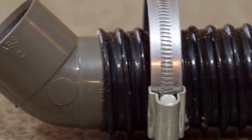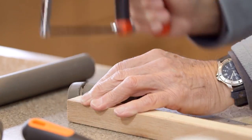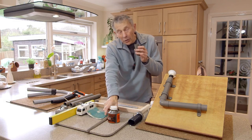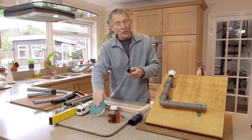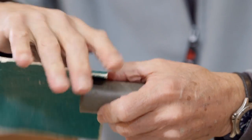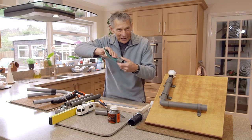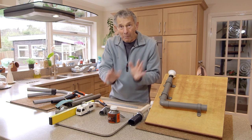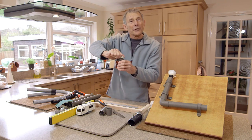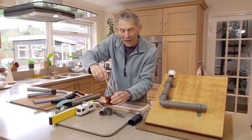So we buy this pipe and let's go through the processes. We can cut it to length with a hacksaw. Once you've got the rough cut ends, you can use a file to smooth the ends and smooth the inside. No less important is to take off the shine with a bit of abrasive paper, and similarly on the inside of the couplings take off the shine there too. Once you've got it all checked, interlocked, measured up, and pre-cut, you use this adhesive — the kind used on guttering and rainwater systems — which comes with a little brush in the lid.